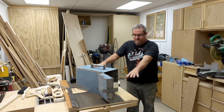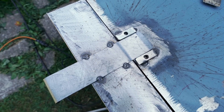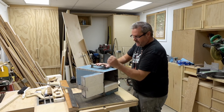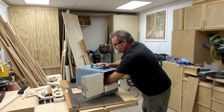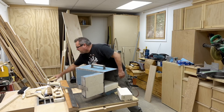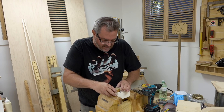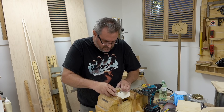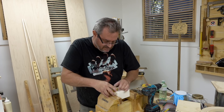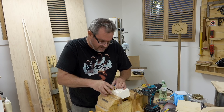Later that same day I mounted the door, I put in a few extra minutes to add this kind of lock — it also acts as a handle. It's just a strip of metal that I bent and welded on. I've also put the bricks inside the door, and that was a good fit. Then I've put the ones in here on the floor of the kiln. What I'm getting ready to do now is trench out these bricks on the side for the element. These slots don't have to be perfect — I just need to be able to seat the element wire, and staples that I'll make from the wire will do the actual holding.